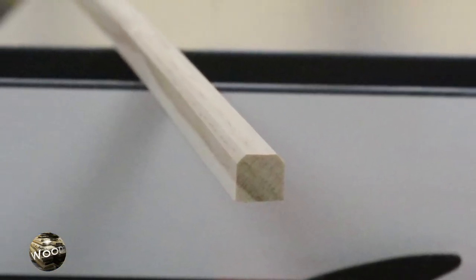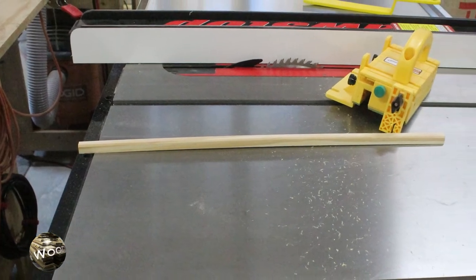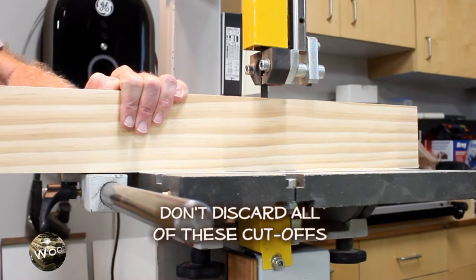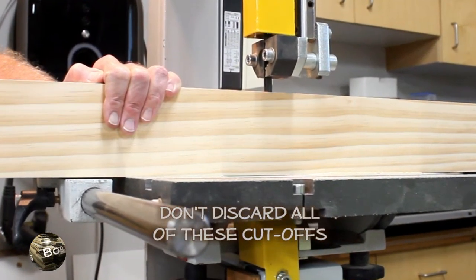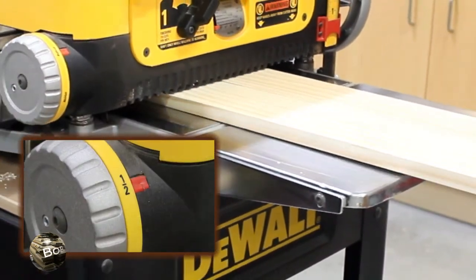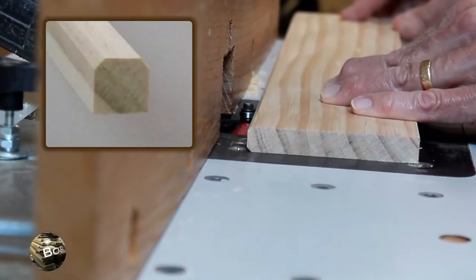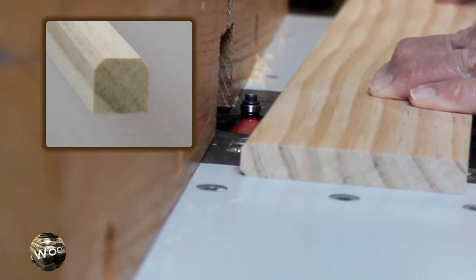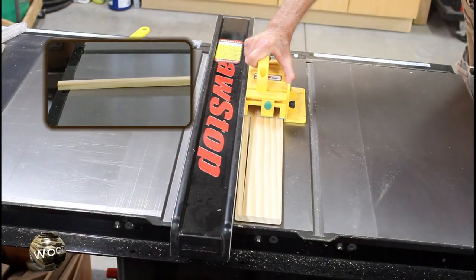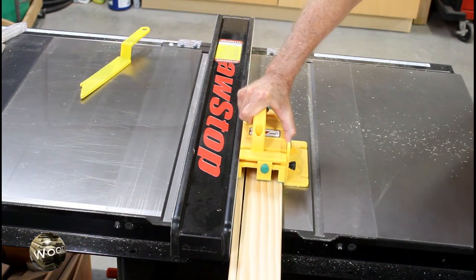On to the tambour door. The tambour door splines are one half inch stock, 21 inches long — I'll need 50 of them. I start out with one by fours, select grade from Home Depot, take them to the band saw and resaw down to close to half inch, then to the planer to remove saw marks and hit the final half inch thickness. Once I have my half inch stock, I take it to the router table to put a small chamfer on both edges — top and bottom — then to the table saw to cut each edge off at half inch, and back and forth 50 times.